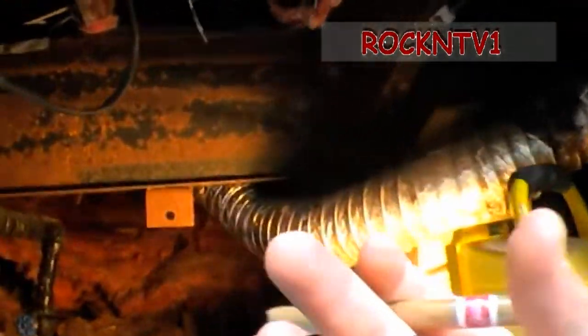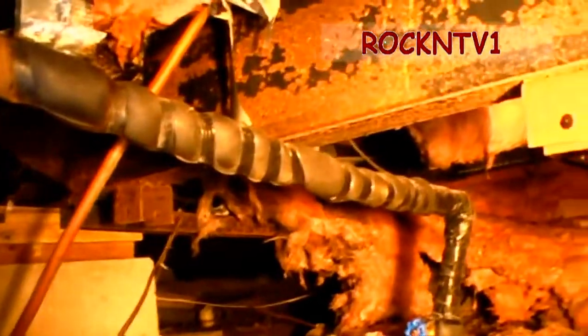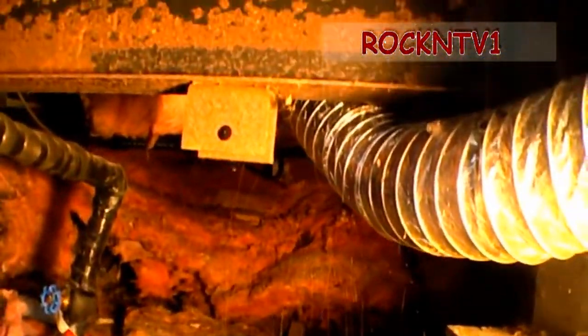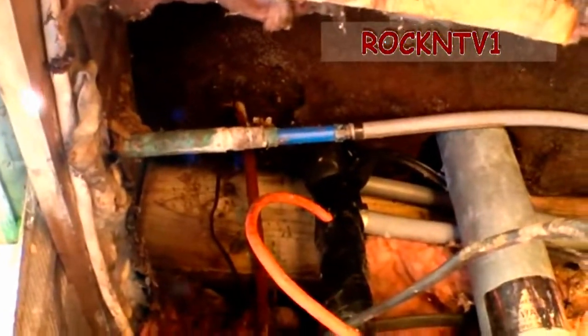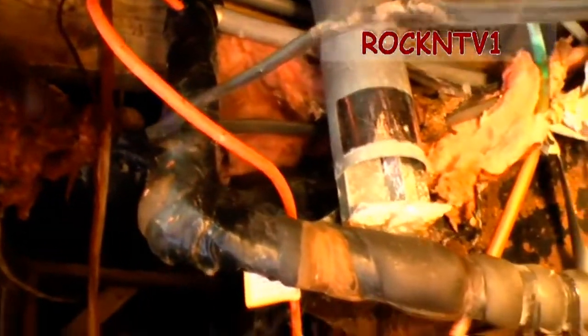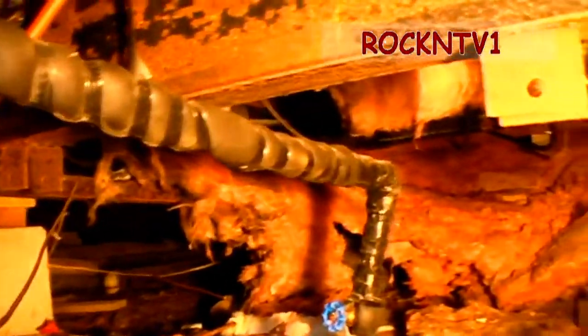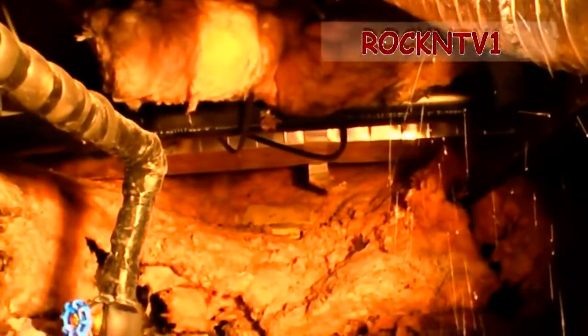Here's a view going inside. It's pretty tight in here — about 14 inches for me to work with underneath some of these carrying steels. Here's the plumbing issue. They evidently had a fire here. We're going to try and straighten out all this mess, including fixing up that ductwork, that main duct that's in there.